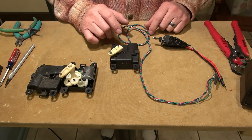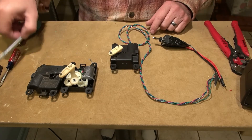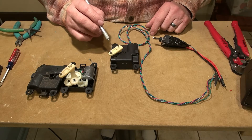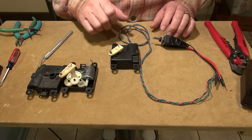I'm going to take the driver chip out of this one and put it into the other one. Before I took it apart I marked the orientation of this control arm, because you can get it in a different position, so I'm going to be careful to try and get it back in that same orientation.